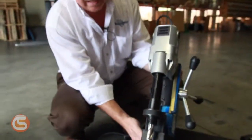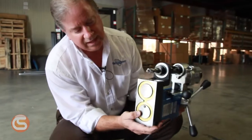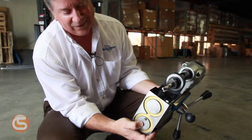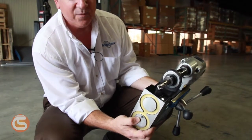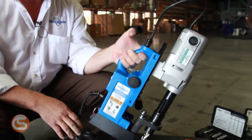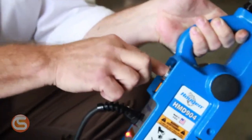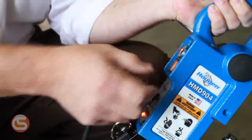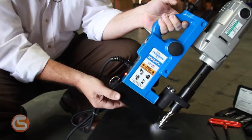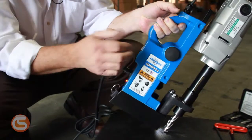All these tools are fitted with a safety feature called a lift detector switch — a simple mechanical device that senses any kind of movement and then shuts the motor off. There's an interlock system on this, so if that switch is not engaged we can't start the motor. Doesn't matter if you have the magnet on; without that switch engaged it just won't work.